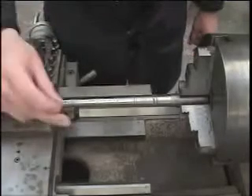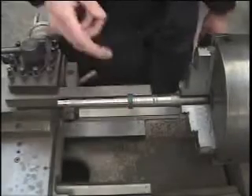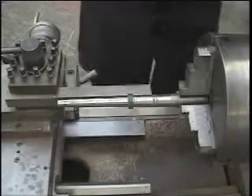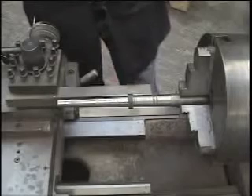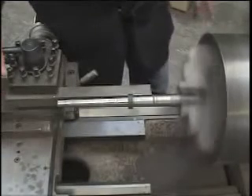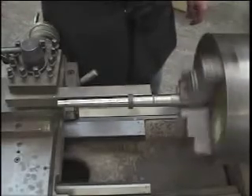I'm going to demonstrate how to properly set up your wax piece on the lathe — simply grab your piece and slide it up the tapered mandrel until it's firmly placed. From here, grab one of your cutting tools. Having familiarized myself with the machine, I'm going to turn it on for the first time with my wax piece in place. As I lift the handle to turn it on, it creates rotation. As the machine gets up to speed, remember to keep your hands clear of all the moving parts — that's the key safety consideration.